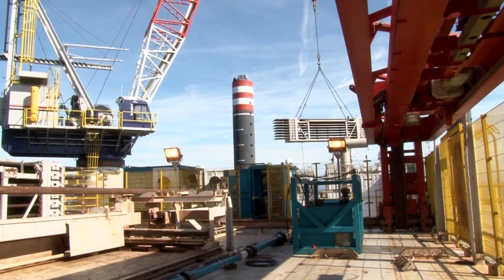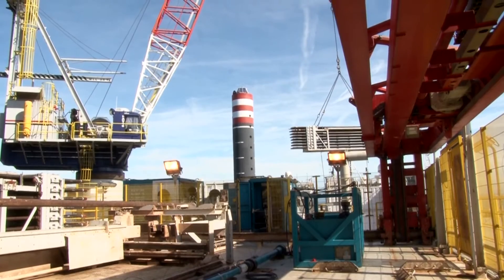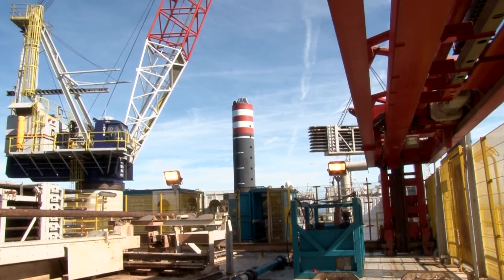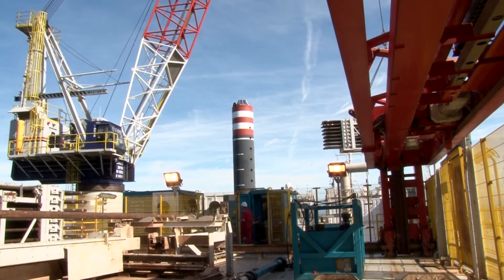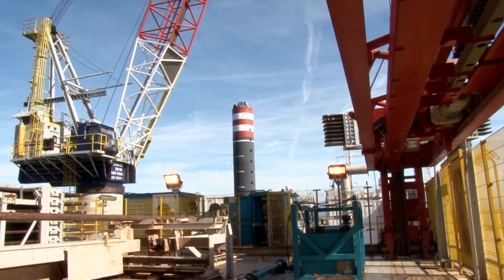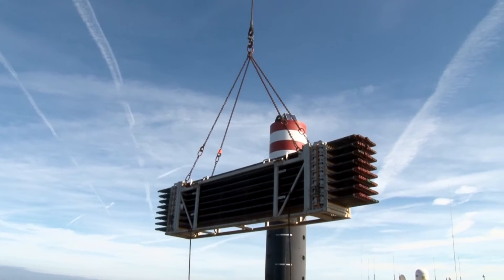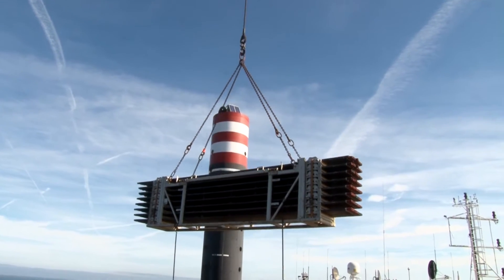The Swift 10 has one large diesel hydraulic crane that can reach all areas on the rig and the cantilever. The crane has an electrical hydraulic backup motor. The crane can lift up to 50 metric tons from a boat and loads up to 85 metric tons on board.